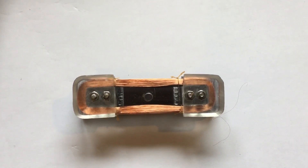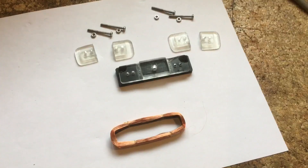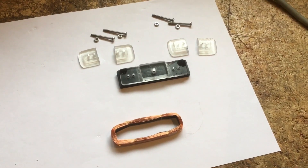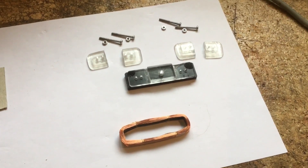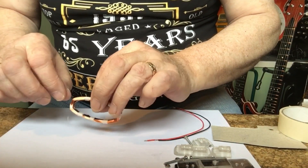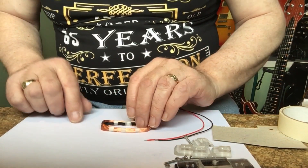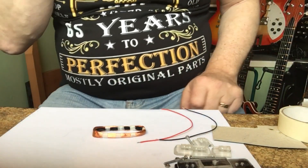That's all four ends tied off. I'm now going to remove those little nuts and dismantle the bobbin so that the copper is now free. There's the coil in its raw state with four ties on it, and the disassembled parts of the former. I'm now going to tape over the cotton, and I'm going to put four extra pieces on before I solder on the leads. There we have the output wire, marked with a little piece of tape, and that's the inner wire, which isn't.